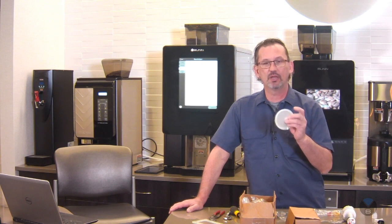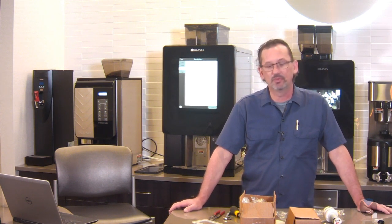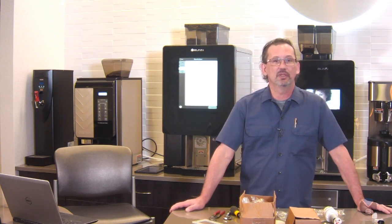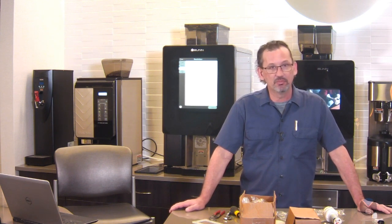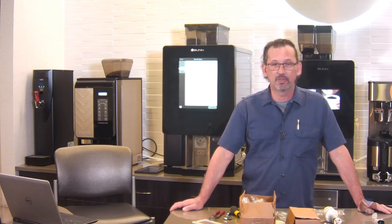The brew screen can get clogged up with coffee residue. So if somebody didn't clean or rinse it whenever it was shut down and turned off, the first brew that they try to run could give them a vacuum error where it won't run. It couldn't get the liquid through the screen. So if you're coming up on that 12-month PM, you might want to do that. At least go in and freshen them up and run a nice cleaning cycle. But if you're anywhere around the time frame, you might want to go ahead and do it now. I think everybody's thinking that once everything gets up and running again, there's going to be a shortage of service personnel, and a high demand for service with not enough people to go out and perform all the service. So anything you can do during the shutdown to be ready for a startup again is probably a good idea.